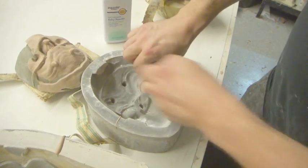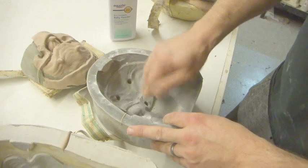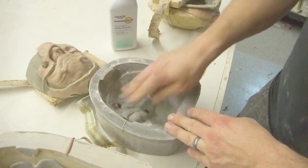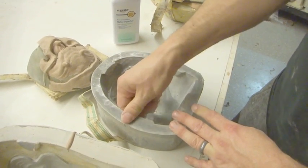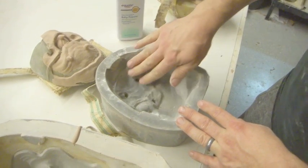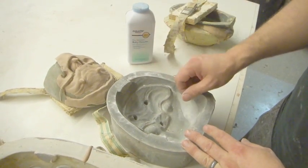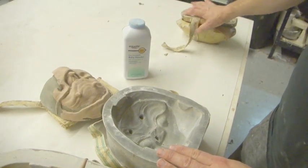I know that we looked at those when we were looking at all of our different things that can go wrong with foam, and I forgot to mention that in the delamination section where the skin was kind of separating. Running it in a warm mold will do that as well. That's because the warmth from the mold will set the skin before the rest of it is set chemically, and it causes problems that way. So that's how you demold a mold.